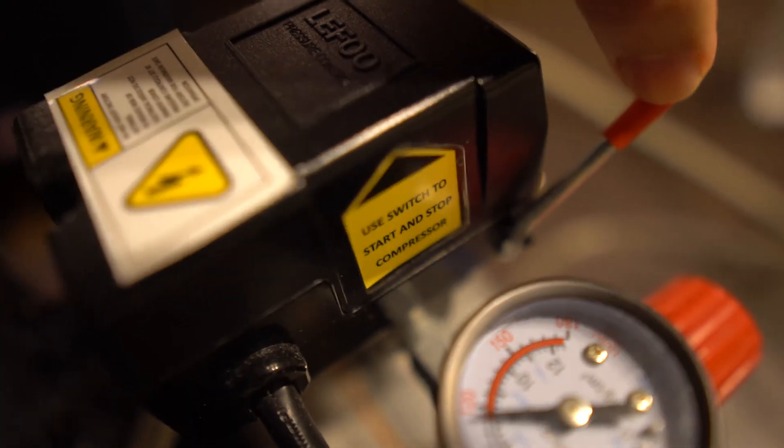There's also a pressure reading you can see on the dental unit itself, and you'll see it go down as you're using it as you keep pushing the foot pedal. The compressor will realize that and automatically start driving air in and pumping it again. You can also turn the compressor on and off with the red switch — once the dial reaches the red mark, you can pull up the red handle and it won't turn on anymore. I usually just left it on because the compressor was good at automatically cycling on and off. You don't want your compressor left on when not in use, and you definitely don't want extra air stuck in it when it's off.